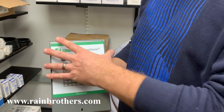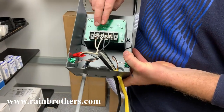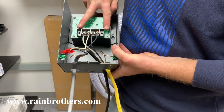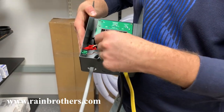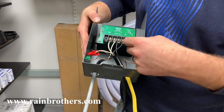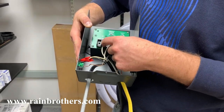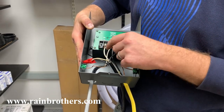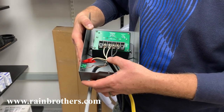The wiring of the Pump Saver is very straightforward. Just like a pressure switch, it has an in and out on either side of the device. This gray wire is our supply going to the pump. The yellow wire is our supply coming from the panel. We're going to bring line 1 in, line 2 in over here, and then we're going to send the load out — L1 out, L2 out on the other side.